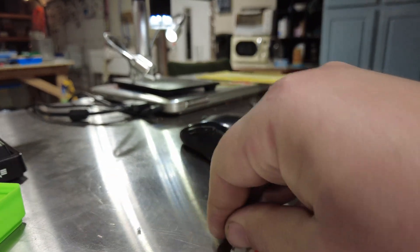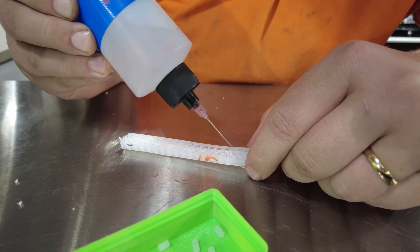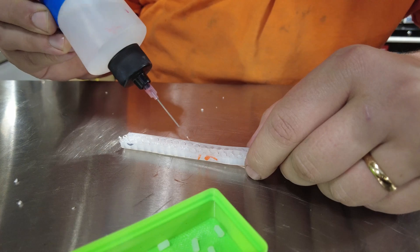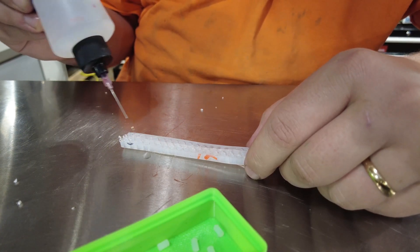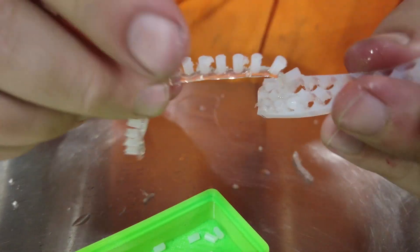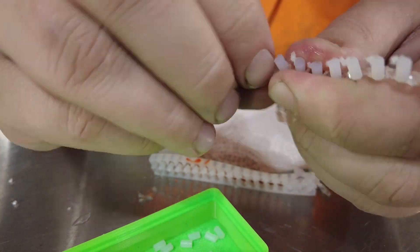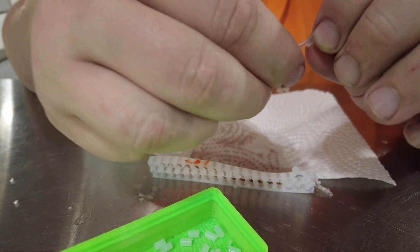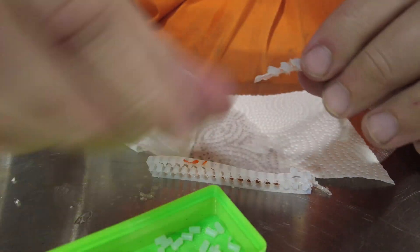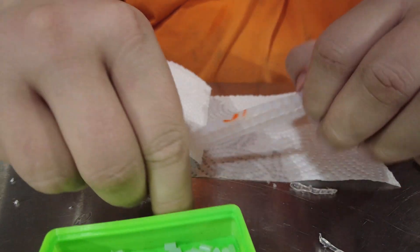They're all still here — that's a good sign. They will hopefully come off the glue easy enough. What if I try some isopropyl alcohol as a release agent? This normally helps get rid of glue and shouldn't affect UHMW at all. Now if we peel off the glue — I like how I can tear them off and I get this magazine of parts. The glue doesn't seem to be leaving any sticky residue on the parts, so I think we found a winner here. This works really well. I might also put them in a bowl of IPA to help release them a little bit easier. I think we got 100% recovery on this batch.